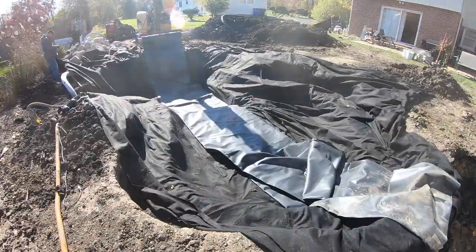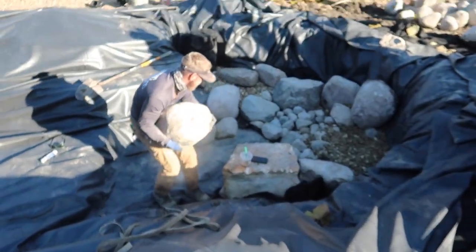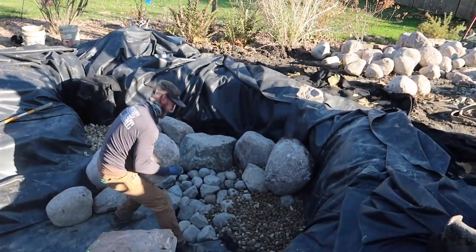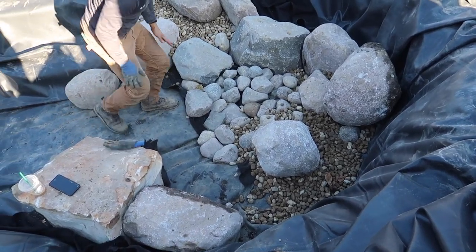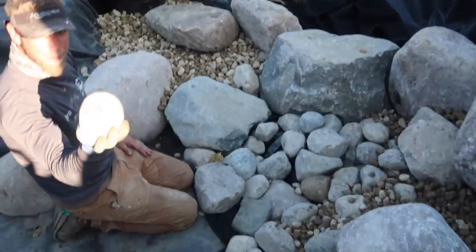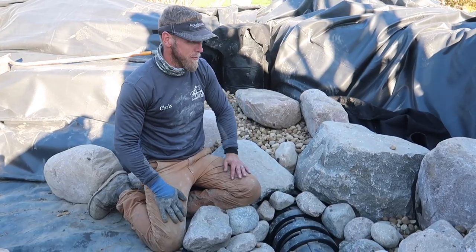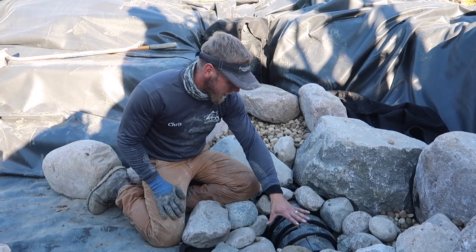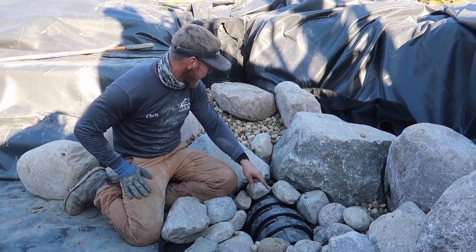Awesome — one thing went right. Progress is being made: fabric, liner, snorkel, centipede, pump vaults in, and some rocks. Chris, give us a quick overview of what we're looking at — move some of those cobbles and show them what a centipede actually looks like. We've got our pre-filter, which is the cobbles over the top of the entire centipede, and we are using the snorkel centipede as a bottom suction over here. All the water will be sucked in through the perforations in the centipede, taken into a pump that sits in the snorkel, and then kicked over to the wetland filter — this goes all the way throughout the pond.